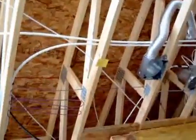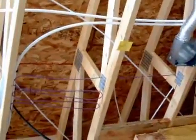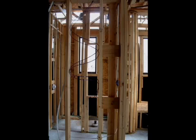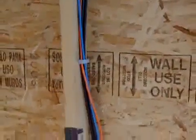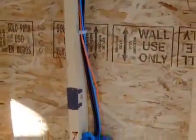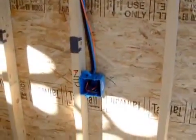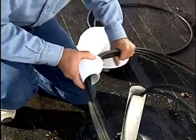The cable to the speakers was zigzag stapled between the rafters for easy retrieval at trim out. We took photographs of each ceiling and wall speaker location we pre-wired to document the cable location for trim out. We also pulled 2 Cat5 and 2 RG6 cables to the service entrance location and provided enough slack cable outside to reach the telephone and cable NID.